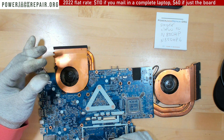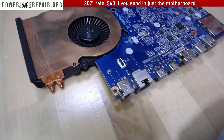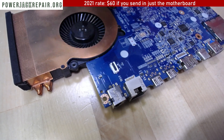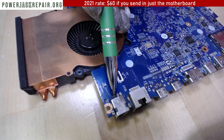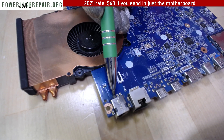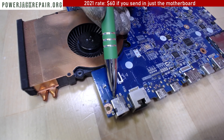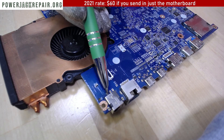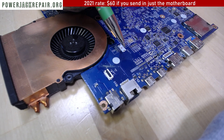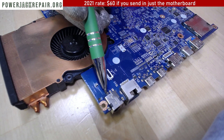This is the replacement part we're going to put in. Let me show you what the problem is with your laptop — I'm sure you have exactly the same problem because it's going to be happening to every single one of you who has this issue. You see this connection right here — it's all black and oxidated. This is the positive. It doesn't make contact with the motherboard well because of this oxidation, because you had to wiggle the plug back and forth. The oxidation basically means there is a spark happening between the motherboard and the pin, and because of that spark the current doesn't go through to the rest of the motherboard. It does go through sometimes when the arc happens, but for the most part this is your problem.